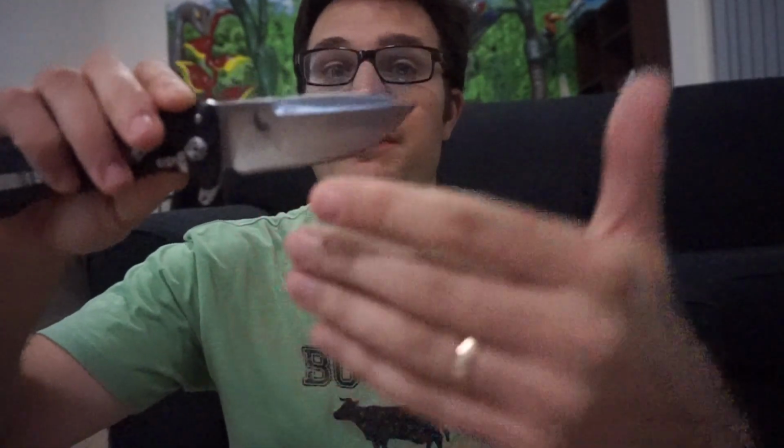Yeah, it's got some other stuff that will help it, but from what I understand, this might be more geared towards being a tough steel rather than an edge retaining steel. So, interesting result. But yeah, 105 cuts with the Work Sharp edge. So that will be the official score that goes with all the other ones. Because, you know, I was pretty happy that using the green belt, I took it up, made it a steeper, or I guess a shallower, steeper edge bevel. And that did the trick.